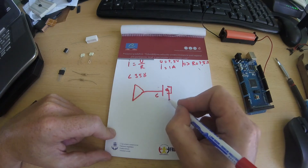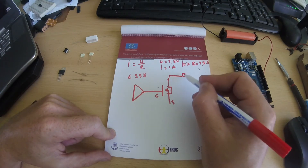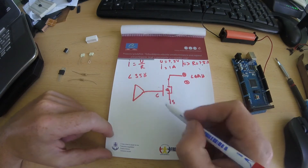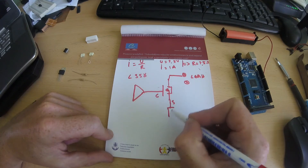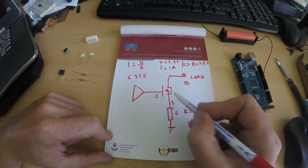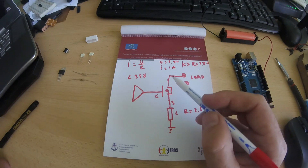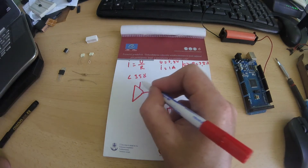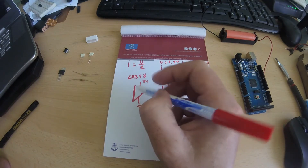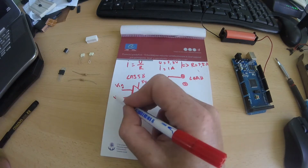Here's the gate, here's the source, here's the drain. We have the load here. I'll put the load resistor after the MOSFET — in our case 2.5 ohms. I'll explain why I put the resistor after the MOSFET rather than before, like in other constant-load dischargers. You also need 5 volts here for the LM358 ground, and we have the V-in plus and V-in minus inputs.